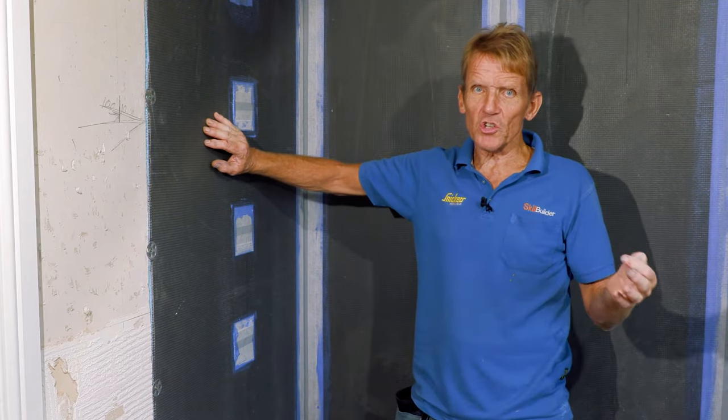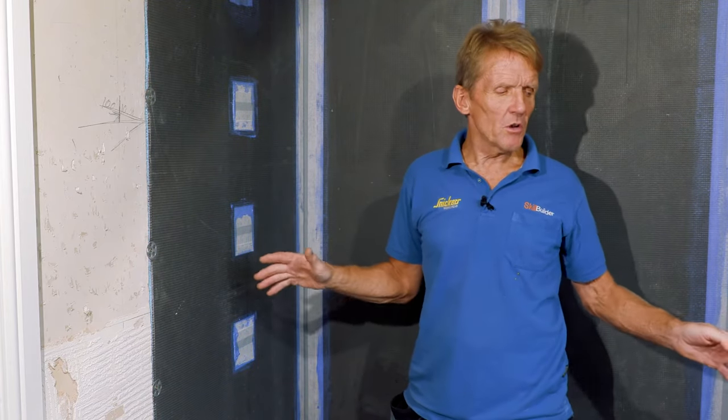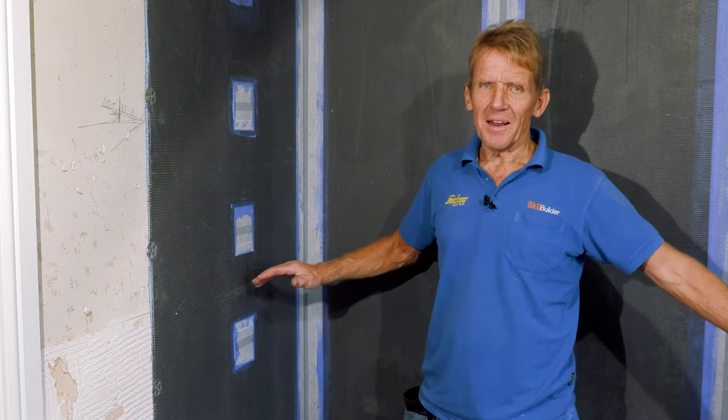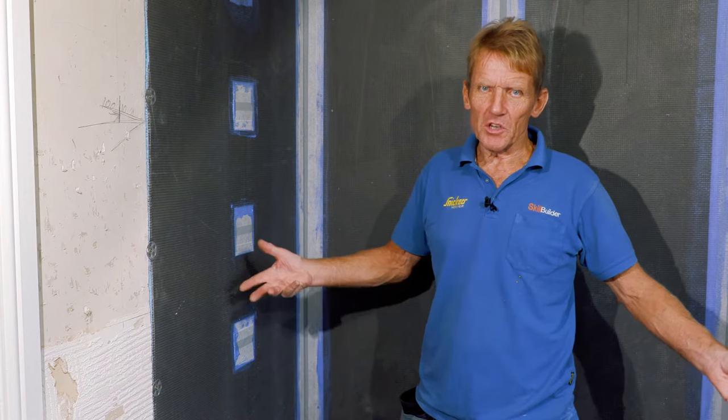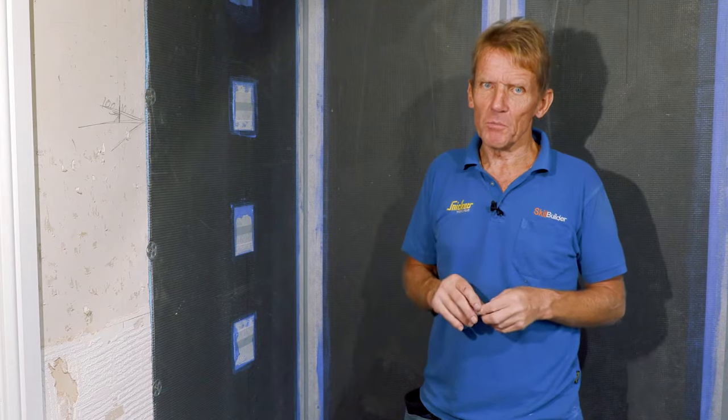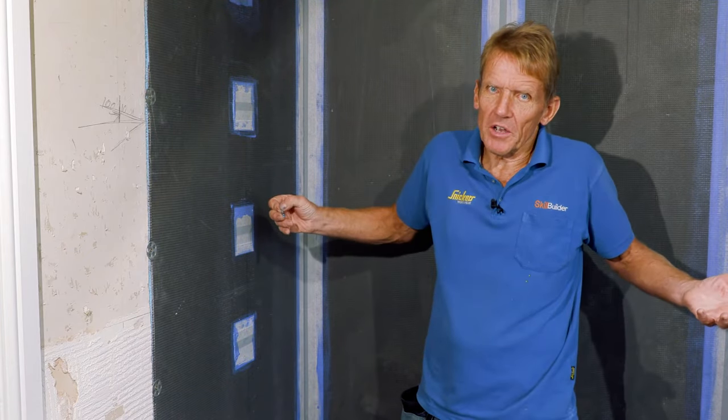But it just goes to show, when you order things, this was the only bit that wasn't supplied by Abacus, was this walk-in tray. And actually, when you order them, say off the internet or whatever, those dimensions are only nominal. So don't build your bathroom around those measurements before you've actually got the stuff on site and can verify that those measurements are correct, which in our case they weren't. Not only was it longer, it's also wider. So we could have come badly unstuck.